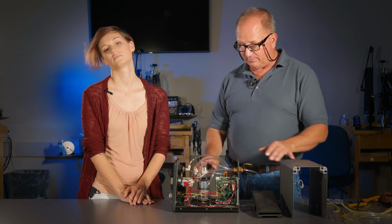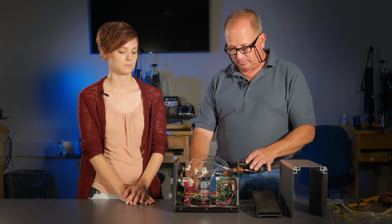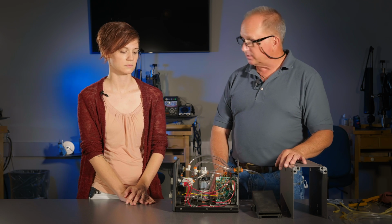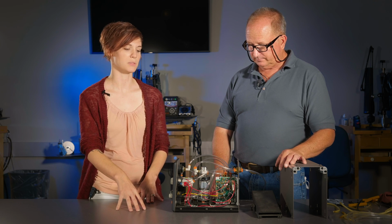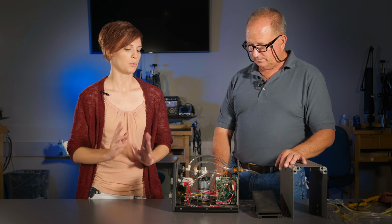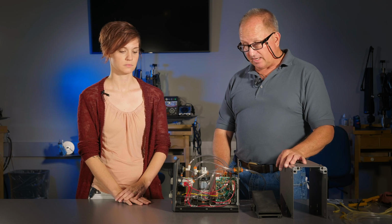And when I have it, I'll not only change the hose, but I'll probably take your tank off. I'll go through and check the O-rings inside of this two-way valve. I'll do a lot more than change the hose, but if you need me to, I'll be glad to do it for you. Okay. What if I know that I need to maintenance my machine, but I just don't have the time? We're really busy at the shop. What do you think we should do then? If you're a busy shop, you're definitely going to send it to me.